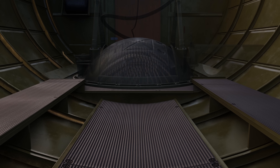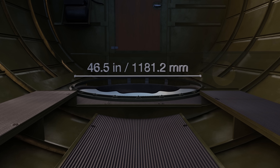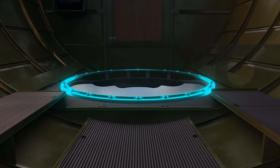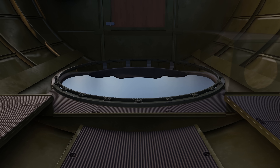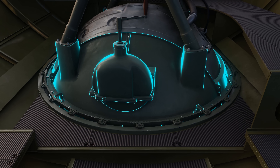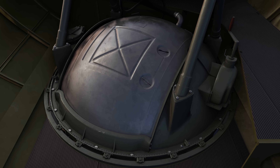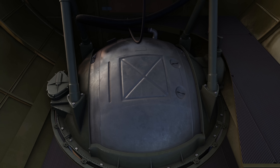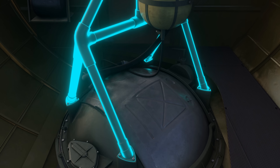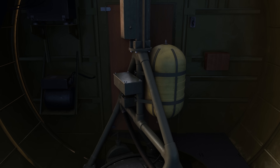There was a 46.5-inch hole in the fuselage of the aircraft to take the slightly larger turret trunnion ring. Attached to the turret and sat on the trunnion ring was the trunnion ring support assembly. This rotated freely as the turret turned. Then came a harness that was bolted to the trunnion ring support assembly, which also rotated with the turret. The harness provided structural rigidity, joining the turret to the airframe.